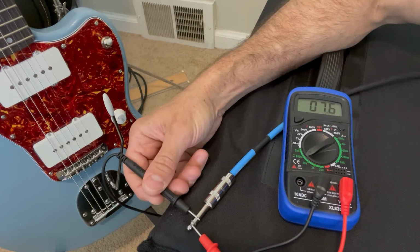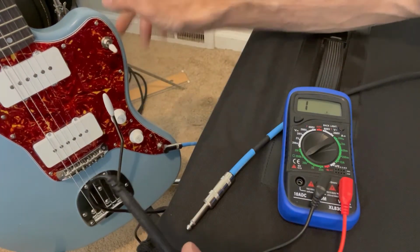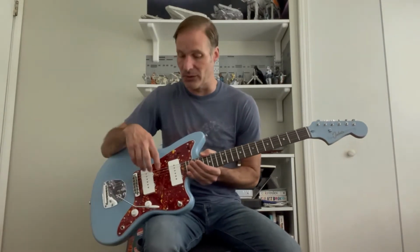So for the neck pickup, I get about 7.6K output. And for the bridge pickup, this is the overwound pickup, I get 13.1K, which is a pretty healthy output, and I'm very happy with it. Like I said, it sounds great. Maybe later on after doing this video, I'll do a review of these Guitar Fetish pickups once I've had a chance to really play with them for a little bit longer. But first impressions of them, they sound awesome. I'm super happy with them. Not to get ahead of myself for the end of the video where I give my impressions, but all right,